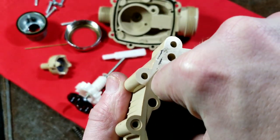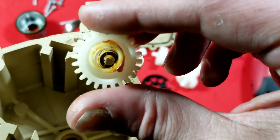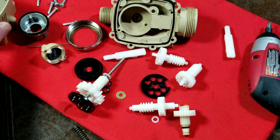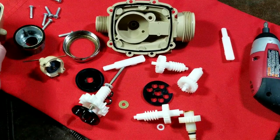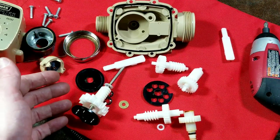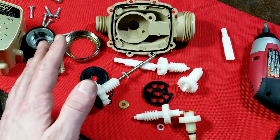Quite a bit of reduction just to drive this little gear inside. It's still e-clipped, so they did a bunch of o-rings to prevent this from leaking. There's one o-ring there and then another one pressed into the inside to seal around the shaft. Anyway, this was just to show one of these water meters. I actually didn't realize it was a particular unit that shut the water off after 1600 gallons or in 1600-gallon increments. That's kind of the point of these teardown videos - to see what's inside. Surprisingly, what seemed like a simple water meter was actually a 1600-gallon increment water meter and limiter with all these different gears, parts, and seals inside. I really appreciate everybody watching and subscribing. If you haven't subscribed, please do subscribe to the Caddis Maximus channel. Until next time, Caddis Maximus out.